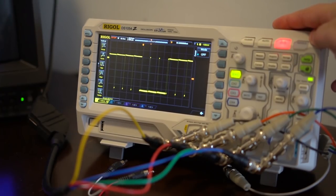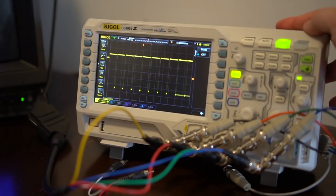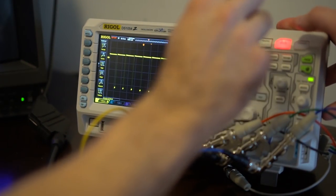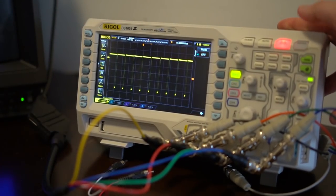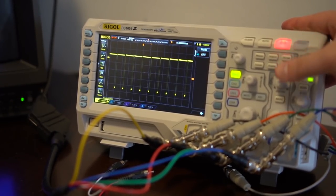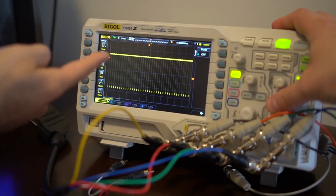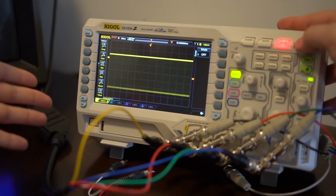So how do we set it back to the other view? Just hit run. It went from red to green — here's what we were looking at before. All single does is run-stop, run-stop one after another. Oh, that's how I have to do it on the older scope. You're not looking at it in real time — single is just taking a snapshot. You can't look at it in real time because if it updates the next time it gets to the edge, it's not going to be the edge you want. That's what makes this complicated — they're both falling edges but they're different.